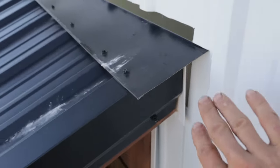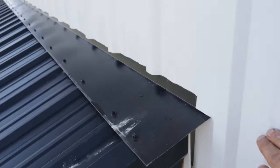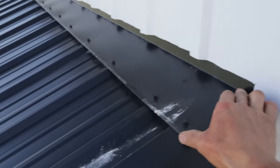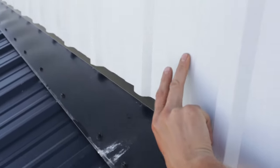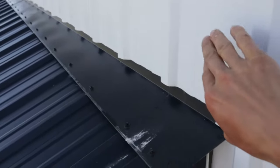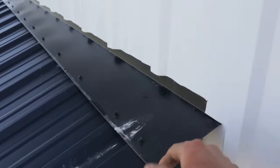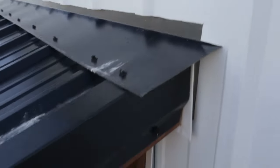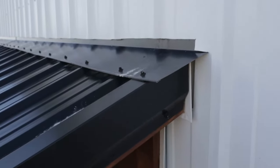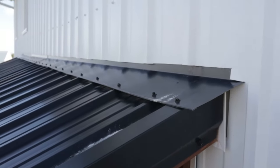If you're going to do some sort of porch overhang or whatever with metal siding, this is kind of what you'd want to do on a wall. You take a flashing like this — a 4x5 or 5x5, this one is about 5 inches — and it comes up here like 4 inches so it's fully sealed in here. Make sure your house wrap overlaps this flashing and then you're good to go. That's how I flashed this larger eyebrow roof or larger awning. It's fully sealed and that's how you can do it with metal siding.